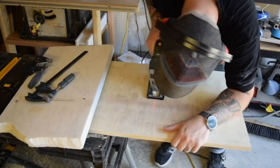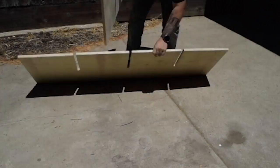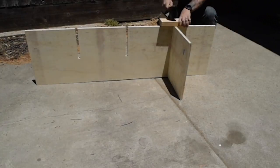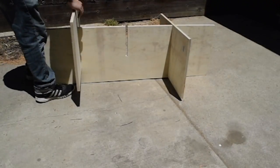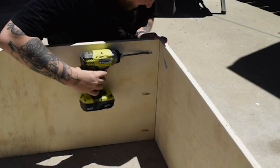I'm using a cut-off of plywood to make sure that the other half-lap cut plywood would fit. I start by putting the pieces together as far as they'll go by hand and used a rubber mallet to make sure the joints are seated all the way. I'm making the unit in this order so I can assemble the outside walls as basically a box, then slide the shelves in and secure everything down.